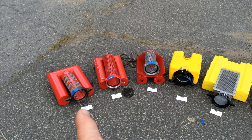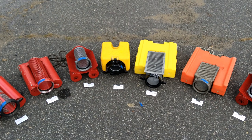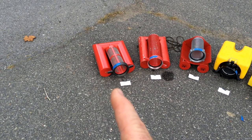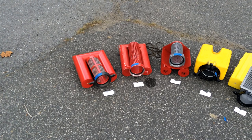These ones down here were pretty close. We saw the video clip on this one with some vortex issues. In several cases, we had to push down the hose to get the coupling below so that there wouldn't be an air leak, and we worked hard to fix that. But at least we know the top end of all these. Peak performance: 1,864 gallons per minute on that one, and 1,699 gallons per minute on that one — although that one had a significant vortex issue where we had to push it below the surface of the water to keep from cavitating the pump.